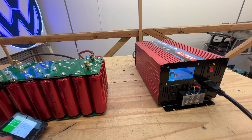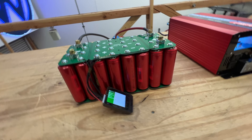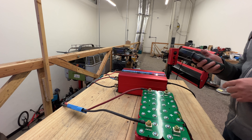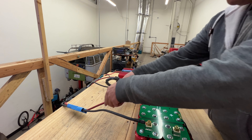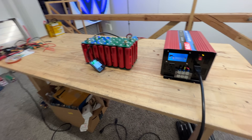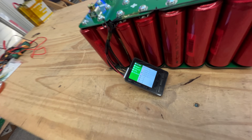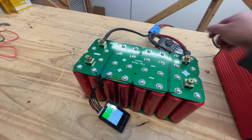So it's always a possibility that it blows up because these are cheap Chinese electronics, basically. I should probably — ooh, look at the cells. Let me put my clamp to see how many amps — DC. So, 59 amps. Let's load it up more. Okay, so that's 1,000 watts. Here are the cells — they're sagging a bit. 86 amps.